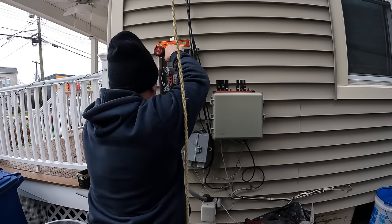Okay, so here we are. This is a hot conductor from the street. And as you can see, this is the old copper connection that was there before. And so I'm disconnecting it, and I'm going to tie onto this. And then what I'm going to do, this is on a Saturday, and it was kind of an emergency here to get this done because they lost the neutral.